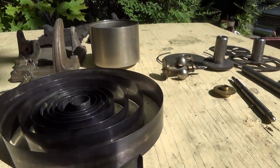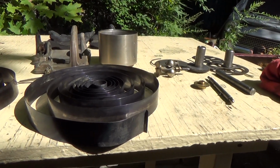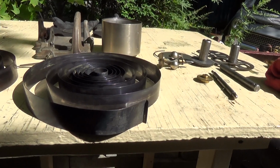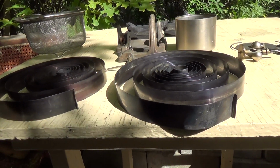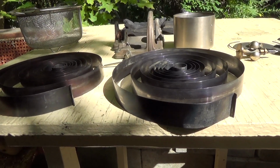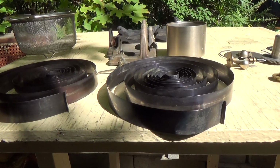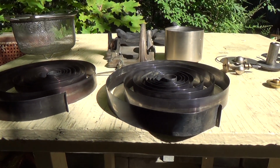And this machine had not been lubricated in a long time. By the look of things, I don't think it was getting decent lubrication, because there just wasn't enough caked on crud on there. It was more dirt than actual grease and crud. And it was very dry. The inside of the spring barrel had a little bit of caked on old black graphite and just no lubrication at all. When I wound it up when I first got it, it was clang, clang, clang, clang. You hear it rubbing together. That's not good. That means that there's just nothing in there. It's dry as a bone.